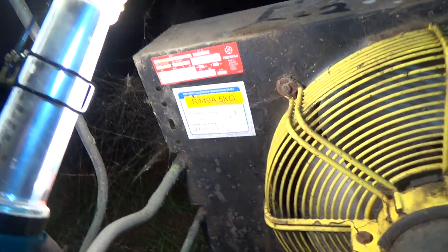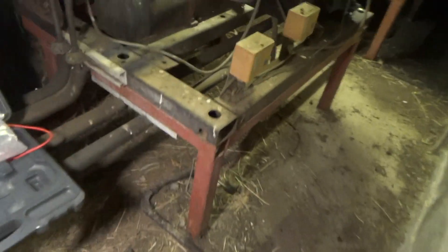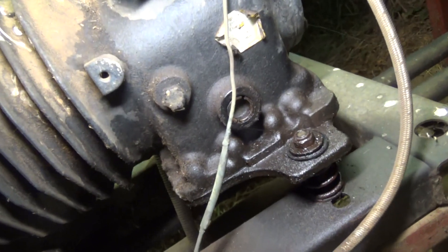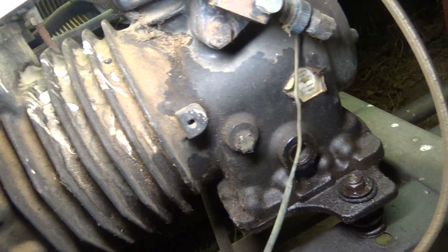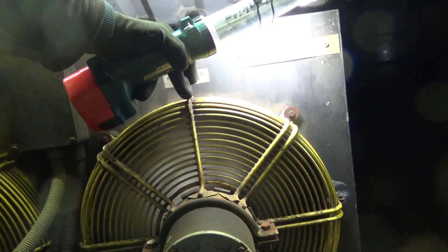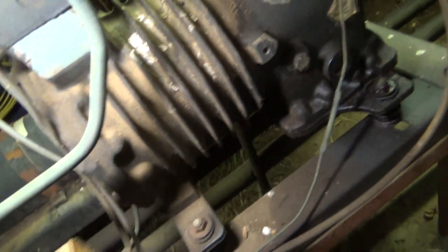This one's on 449A, would have originally been on R22. And then we spotted this one next to it — this is still on R22. It's got a leaky oil sight glass, it's very wet there, and it's looking a little bit short. So that one needs addressing very, very urgently. I think I've got a sight glass kit on the van, but I don't know if I've got enough oil because it needs an oil change — it'll probably be on mineral oil given the date of this. Yeah, it's ancient.